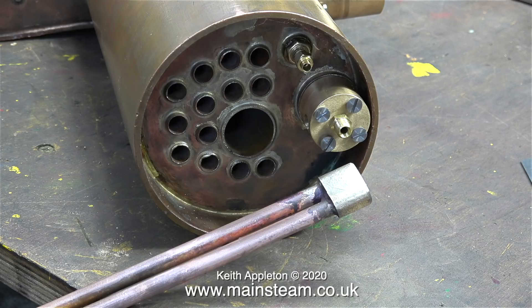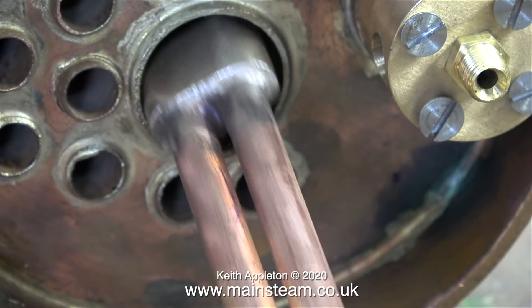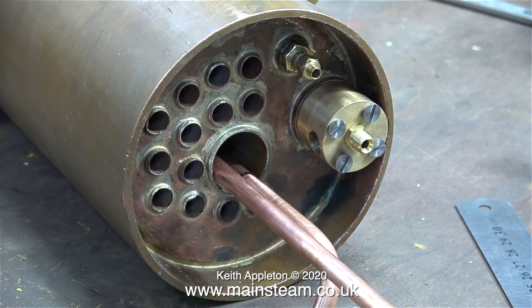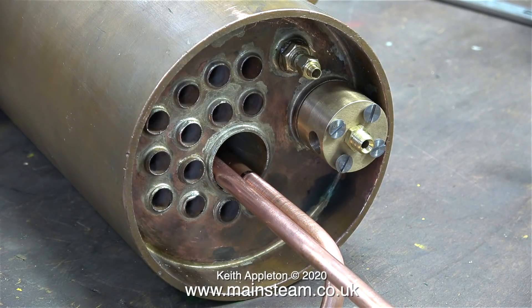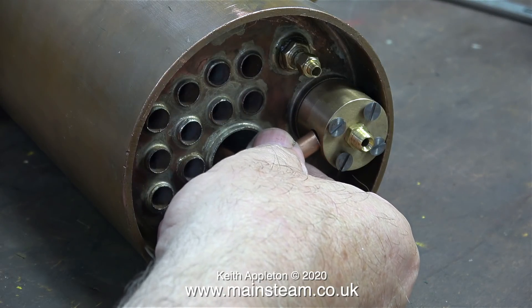This clip shows the block on the end of the pipes after I cleaned it up and shaped it using my belt sander. It's not a tight fit in the flue and it must not be a tight fit — it's just a very easy rattle fit. Some viewers may be thinking: why didn't I use 3/8th diameter tubing? The answer is the block would have had to be bigger and the tubes bigger. For a superheater to work, heat from the firebox needs to go down the superheater flue, and if the pipes and block are too big that won't happen. It's also worth remembering you need to be able to get a flue brush down the superheater flue to clean out ashes and rubbish from the fire.